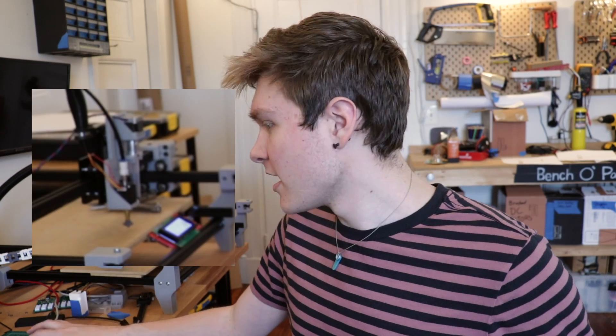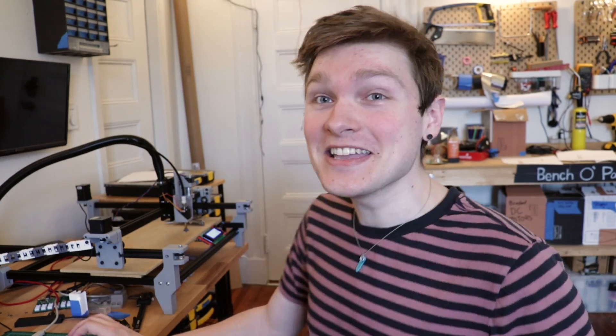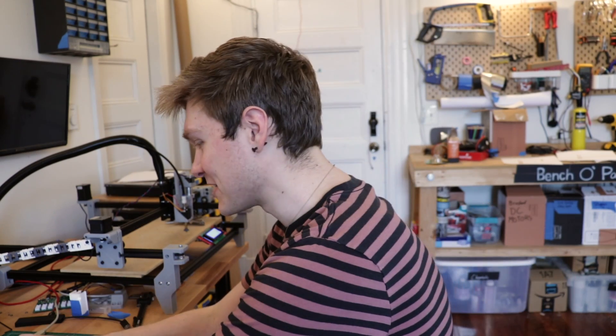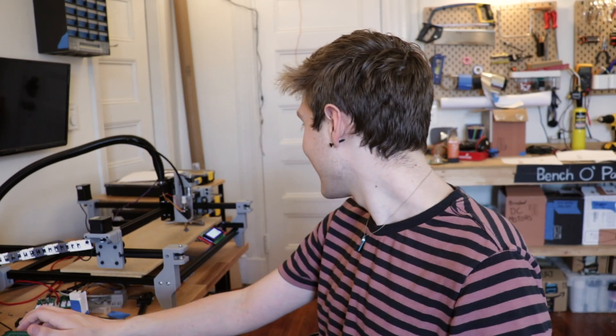Okay, it's all mounted on the head and it moves up and down just like the other nozzle does. It's super top heavy — the whole paste extruder assembly is attached to the linear rail in like a tiny little corner of the whole assembly and it's kind of this big top-heavy thing, so it definitely needs a lot of revisions. But it looks like it's going to work at least for a proof of concept. I just unplugged the rotation motor for the suction nozzle and plugged the dispense motor right into that so I can control it really easily, and it'll just spit out a little bit of paste. That's so cool.